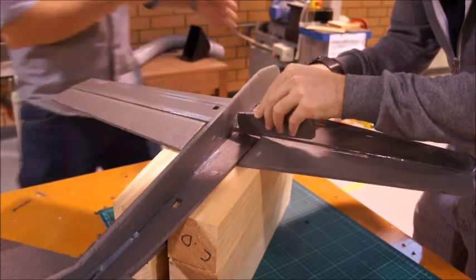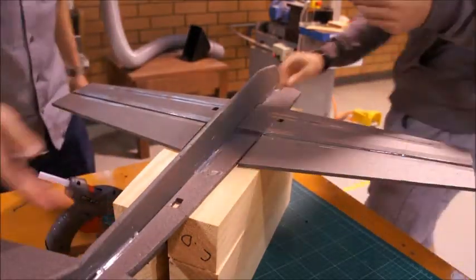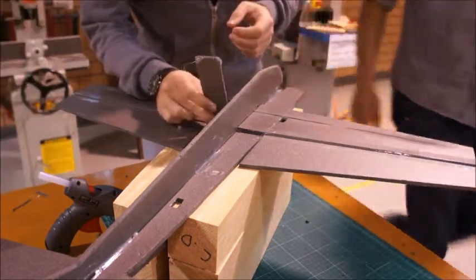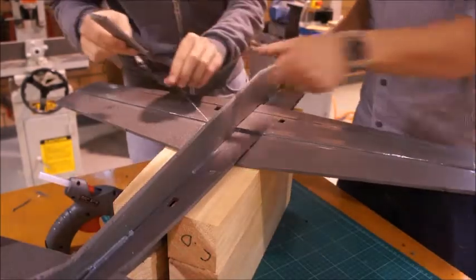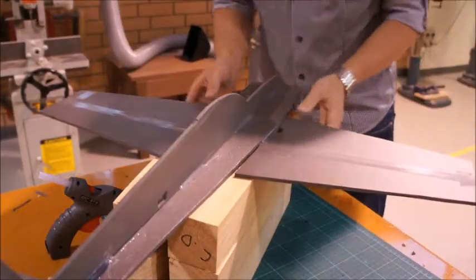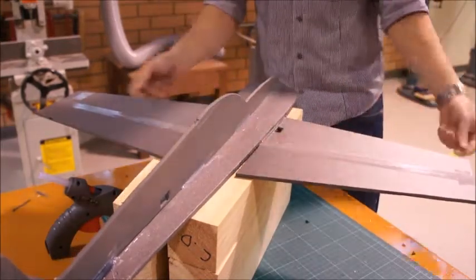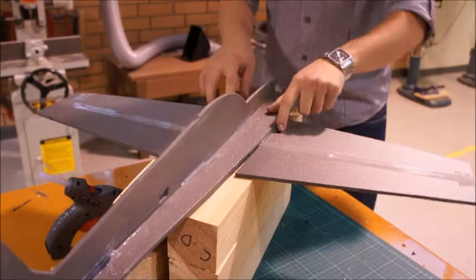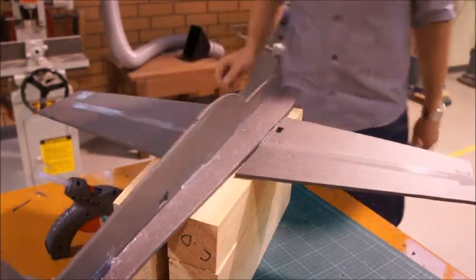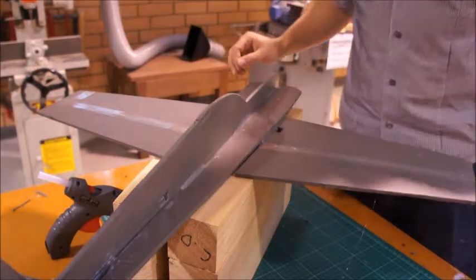Inevitably you're going to be left with a lot of little glue strings hanging around that you're going to have to fix up before you go out flying. Let's just check that's still central — my two servo holes and down this line here on either side — which it is, so happy with that. Next thing we'll do is start attaching some control horns.